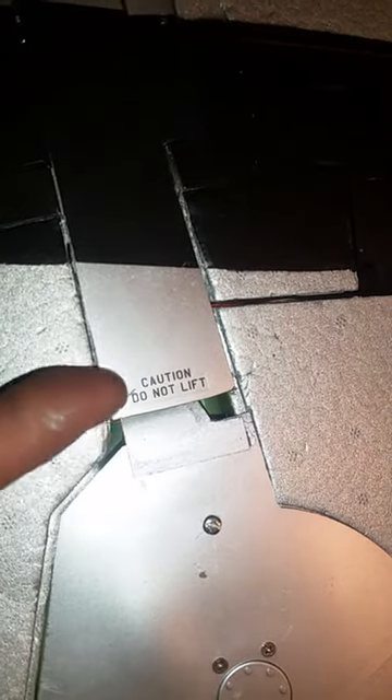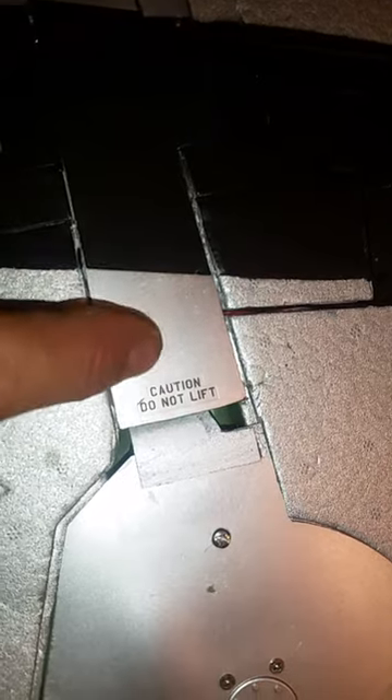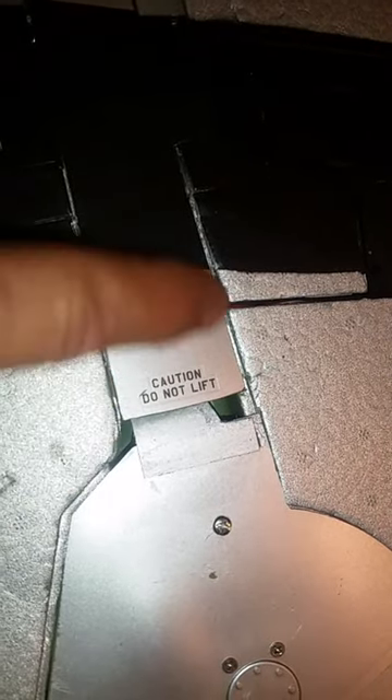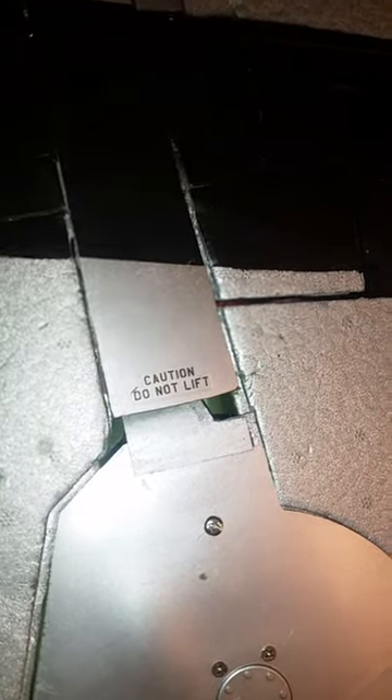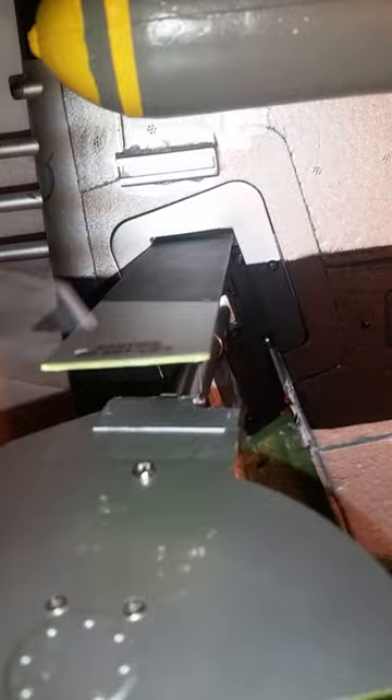What I've done here is cut a little piece of thin plastic and put a curl on the end of it, so that this doesn't get wedged in here. It all has to do with this linkage. That little ramp door prevents this door from getting caught underneath — it allows it to slide over and not slip in behind it and get jammed up.